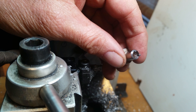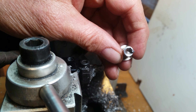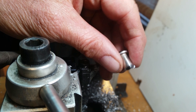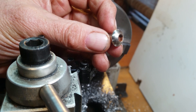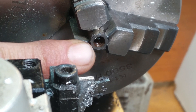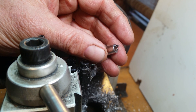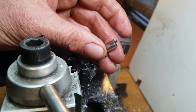With one of those little ironies of fate that make life so interesting, I found out that it wasn't threaded all the way down. So I parted off right where the solid bit starts at the end, which I wasn't aware of. So I have two choices here: I can either drill that out and thread it and retain the utility of having a single piece that I can screw on, or I can use this threaded piece I've just parted off, part another piece off to the correct length, and find another 6mm bolt to go in the end. I quite like having this as a single piece, so I'm going to have a go at drilling and threading that. I'm not going to get that many threads, but maybe I don't need to.